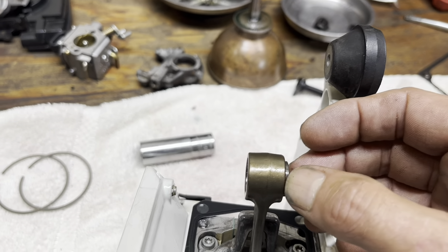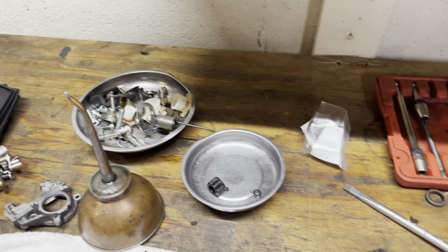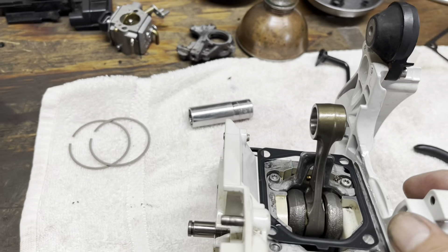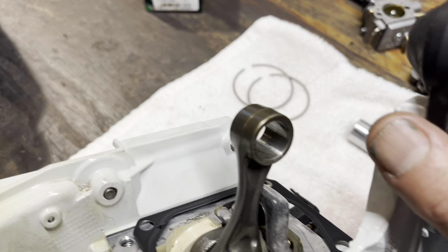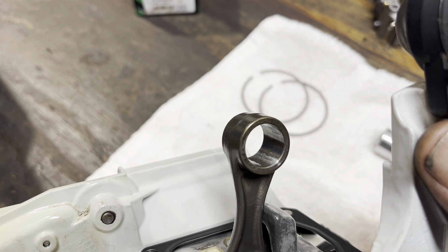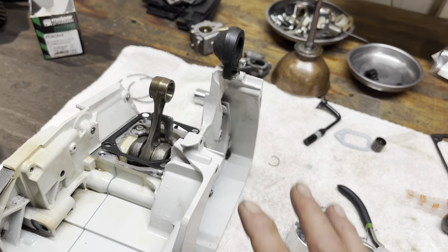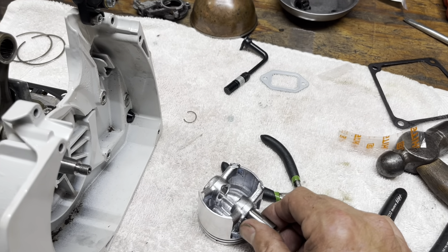I was installing the needle bearing, and we talked about there being a little bit of rust in this saw. There was some pitting, so when I lubricated my fresh needle bearing and went to put it in there, there was a little bit of rust on the inside. Jokingly, that would have self-clearanced, but that would have been hell on this. It's nice and slick right now — there is some discoloration, but it's slicker than a minnow. You have to understand how finely engineered these parts are, and everything should really just be silky smooth going back together. If you notice anything that doesn't feel right, think about it and figure out why.